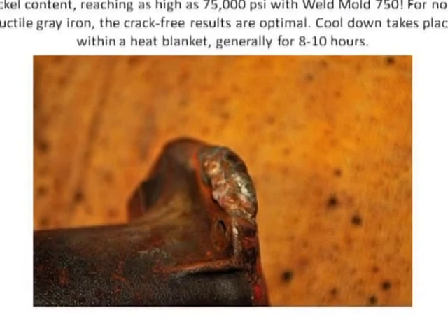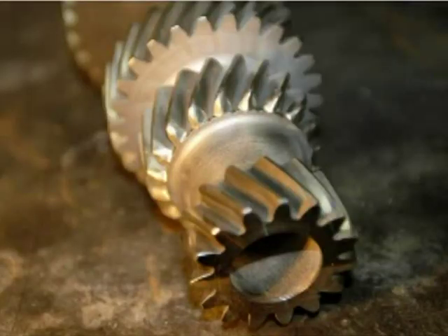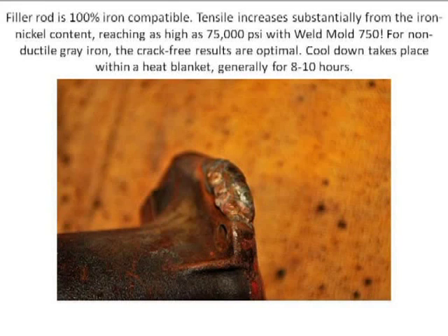The filler rod I used on that gear that ended up heat-treated also came from Weld Mold — specifically for 8620 base material, and it was also heat-treatable. So when the piece was repaired, the teeth shaped, and the filler rod was compatible with 8620, when it was heat-treated it had the exact same characteristics as the base metal. The final heat treating was just as if it was the original casting in 8620. Tensile strength of the weld is way stronger than the original gray iron — gray iron is usually 40 to 50,000 PSI tensile; this weld area could be as high as 75,000. No lack of strength.